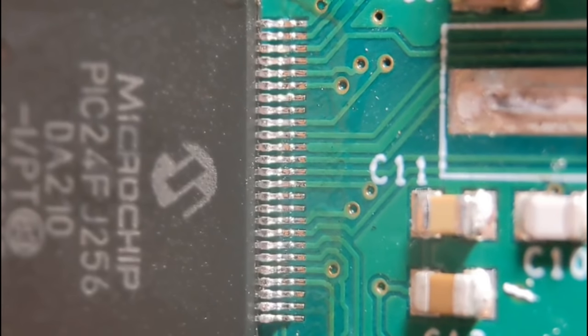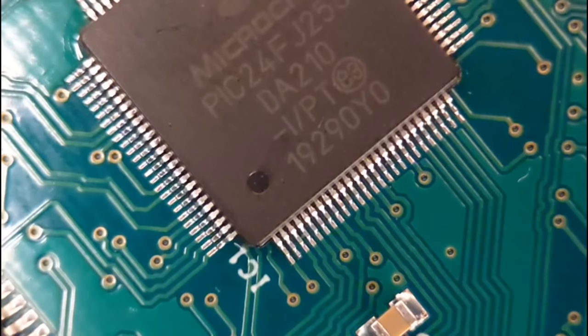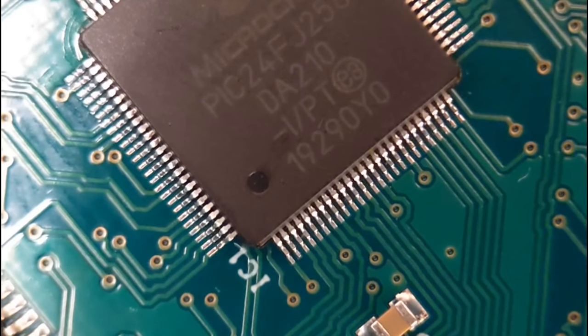I'll clean it all up and put some photos up. I hope you enjoyed the videos - please like and subscribe. One quick correction: at the start I called this a QFN, but QFN means no leads and this one obviously has leads, so it's actually a QFP. A couple of extra tips: get yourself some 0.25mm solder - it really aids you fitting fine-pitch components; it's available from a company called BLT Circuits based in England. Also get yourself a small conical tip for your iron - you'll struggle with a big tip doing pin by pin. Thanks a lot.